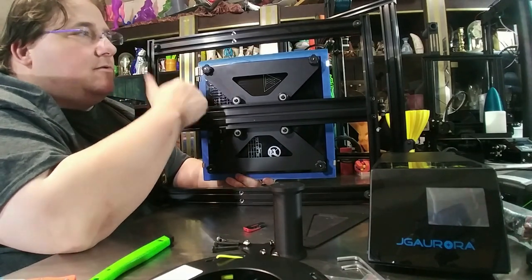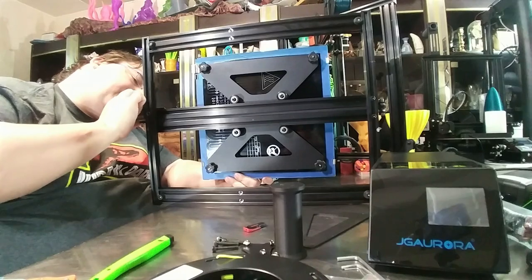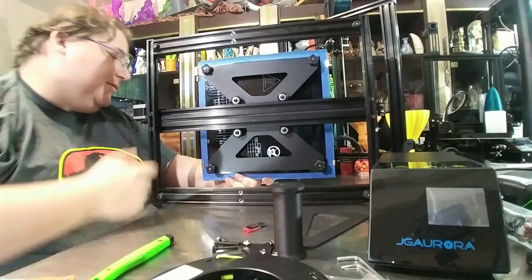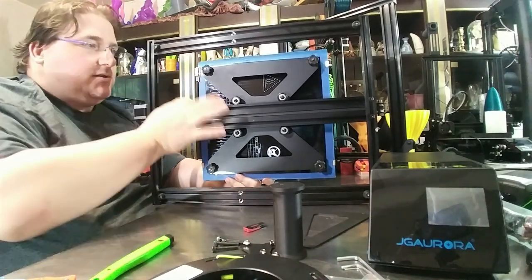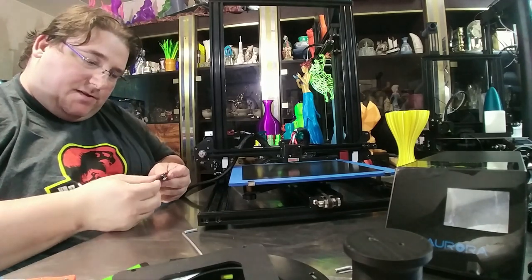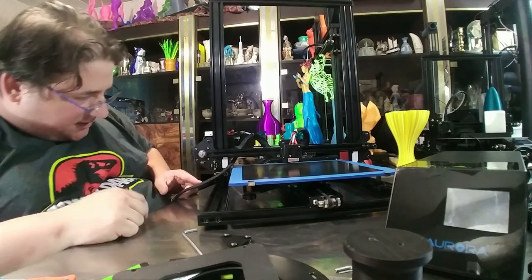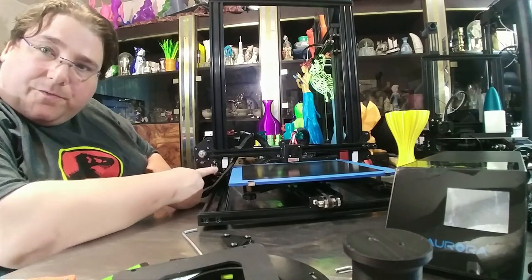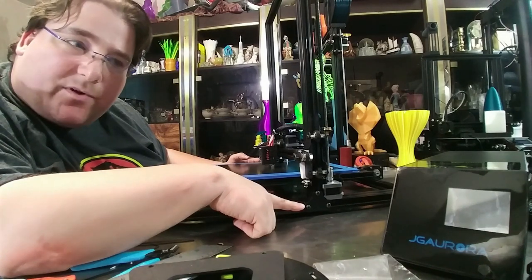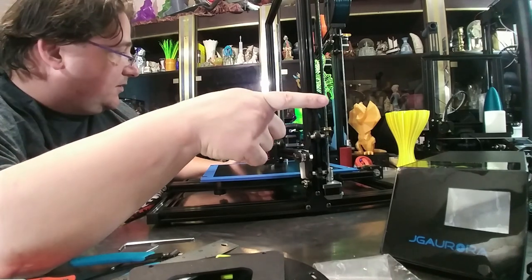They did a good job on the A5, so we'll see how they did on this one. Nice thick metal plates — this does not flex much. End stop is located right here. I do like the way the plugs are sitting so the wires can tuck neatly. Gantry is installed. Next step is to install the little T-brackets on the side that reinforce the gantry — one for each side. Since the limit switches are already bolted onto the front, the T-brackets just get bolted on. The T-brackets are installed using hammer nuts, which will basically finish the construction. Just attach the spool holder to the electronics box and connect the electronics box to the printer.